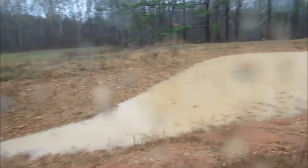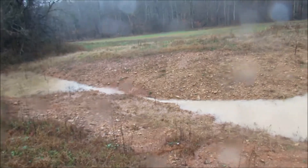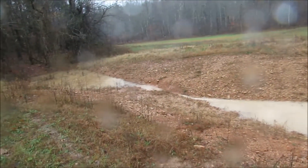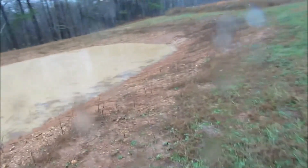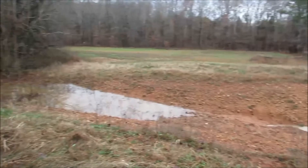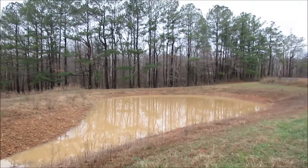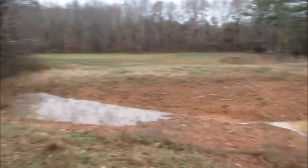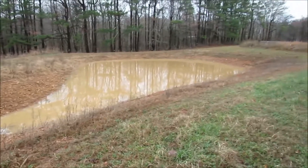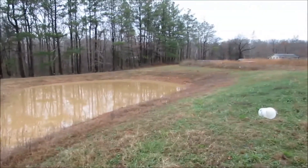This is what happens when you don't put your topsoil back properly — it takes a really long time for stuff to grow. I can't stress it enough: if you're going to build these kinds of things, put the topsoil back. That's the whole catchment. Well, it looks as though we caught the whole event. The pond is just short of being full — the upper pond didn't fill all the way or spill over the spillway, it's within six or eight inches of being full. I did not have any water flowing out of the last spillway in the system, so it caught the whole event, which I think is pretty neat. The pond will clear up and we'll have ducks out in it tomorrow and hopefully start sealing it.